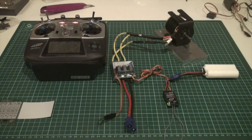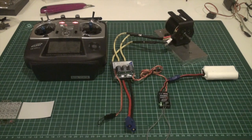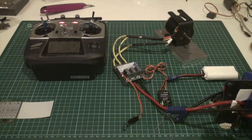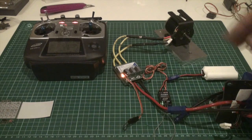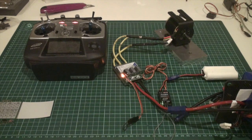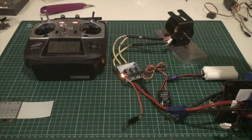In this case, as it's a high voltage controller there is no BEC, so I have to have a receiver pack. If you had a low voltage version you would not need that. What I'm going to do is go to 100% full throttle and then plug in the main battery pack. Wait for beeps to start, then move to zero throttle. That will teach the speed controller what the end points are, and now the speed controller is armed.